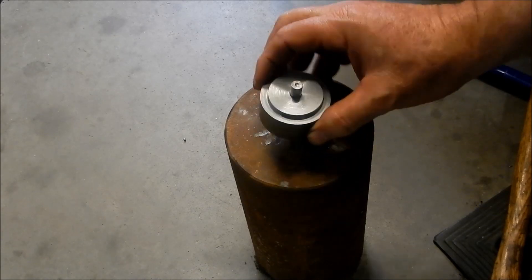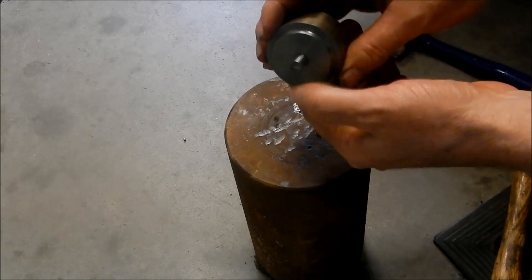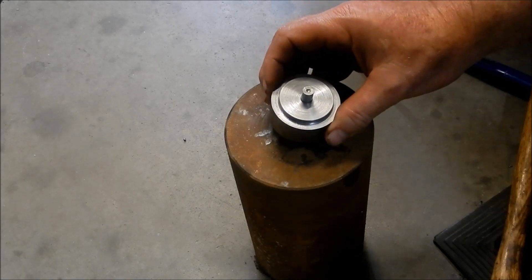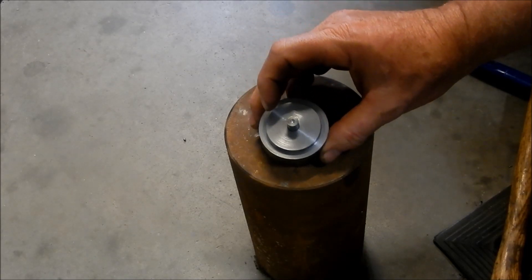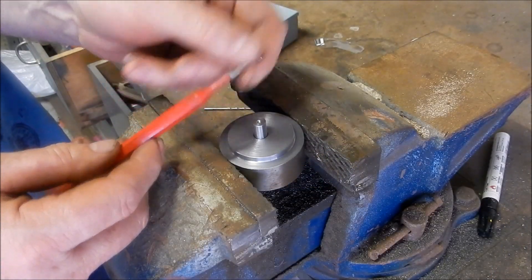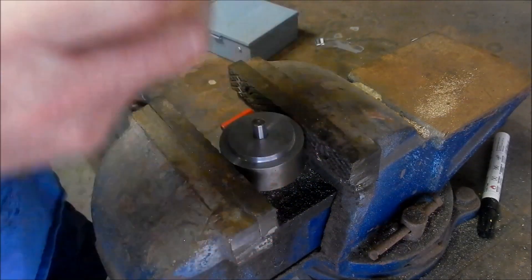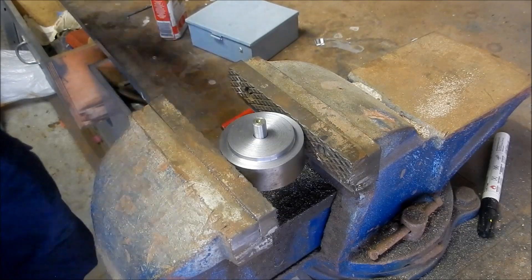So that's at home - it obviously goes in a lot easier when you're on a steel dolly, but I certainly didn't want to do that with the camshaft. That's in there pretty tight. All right, let's head over to the bench and the vice, set up and drill that through. We'll use a 1/8 pin punch and see how we go. I'm going to drill this out at 3mm and then drill through at one eighth, getting this opened up as close as we can to how it would be in the field.